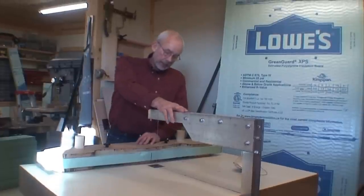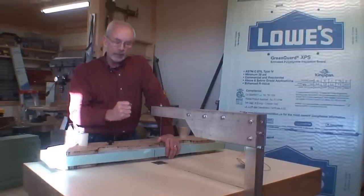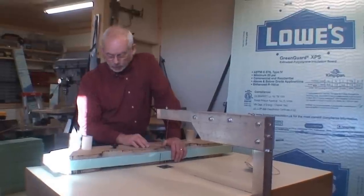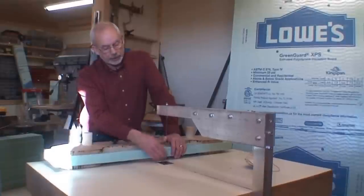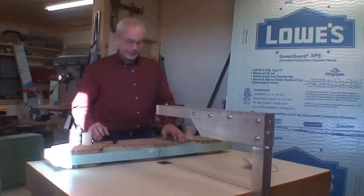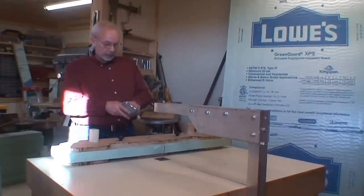The only thing I'm doing here is I built a hot wire cutter — it's just an arm that comes out over and goes down into a heavy spring clip that pulls this nichrome wire tight. It's an 18-gauge nichrome wire and I hooked it up to a battery charger, which essentially is shorting out this wire. In a second you'll see it turn red. I've got it set at 40 amps. I turn it on and it'll smoke a little bit.